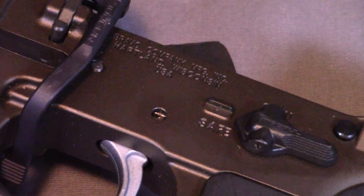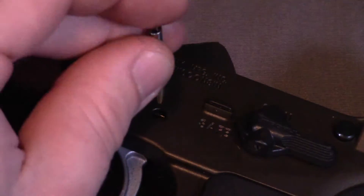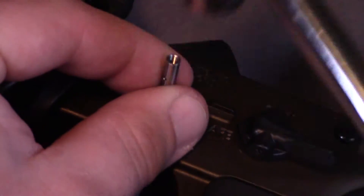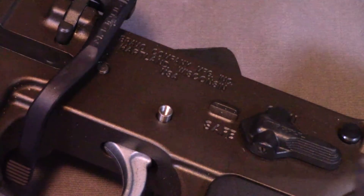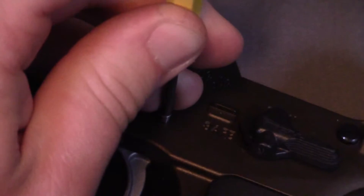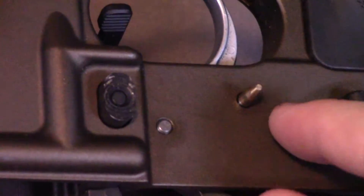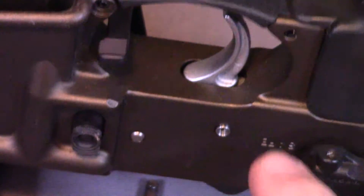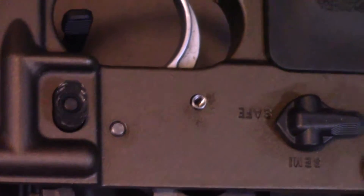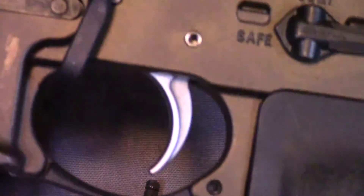As you can tell, that pin is no longer flush with the surface. So I'm going to take the replacement pin — this one with the little guide installed — and basically just tap that in behind it. Now that it's getting closer, I'll use this punch so I don't damage the finish on that burnt bronze coating. As you can see, all I have sticking out is that little gold bullet — go ahead and remove that. Depending on your receiver, you may notice a little bit of a gap on one side; that's totally normal. It's better to have it stick out a little than to have it too far recessed.